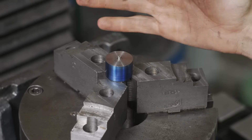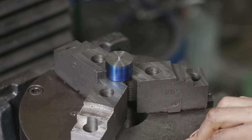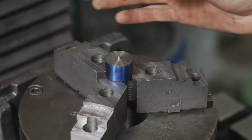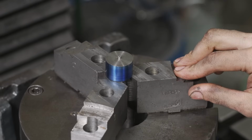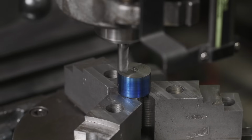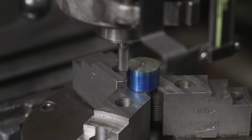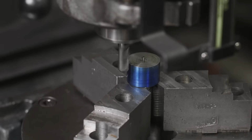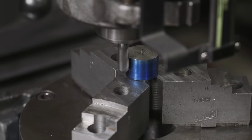As far as cutters, we're gonna be using a ball nose end mill to get a nice radius here. It's a 3/8 solid carbide. It's not the best condition one. Ideally, I would be using something that's maybe 1/4-inch, get a tighter radius, but it is what it is. Should work just fine. All right, let's get the mill started. Gonna be running 1200 RPM. And the first step is just gonna be to touch off so we can get a zero. There we go, there's our first chips. Let me zero the Z axis, come off the edge. We're gonna come up our 525 and then lock the knee. We're gonna touch off, all right? So we can zero.